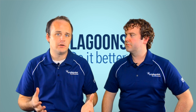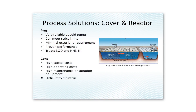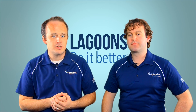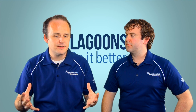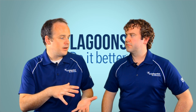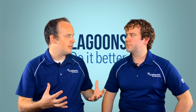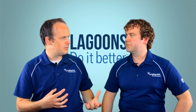This works great and can achieve really low ammonia limits. However, lagoons are big, so the cover costs significant money — it's a high capital expense, and then you have to maintain it. We've seen issues with vegetation growing on the surface and UV deterioration requiring cover replacement. Ultimately, you're paying for temperature control up front for 10 to 15 years, whereas you really only need it for two to three months out of the year. We think of it as a somewhat inefficient way to deal with the temperature concern.